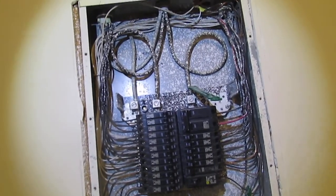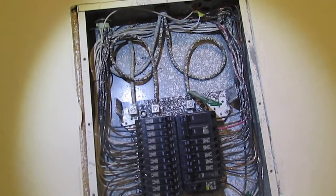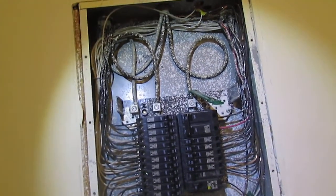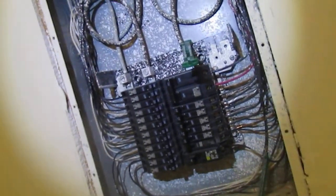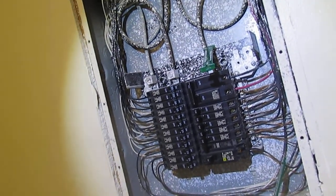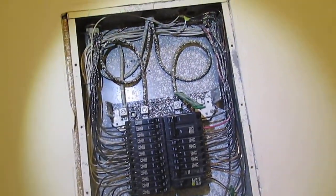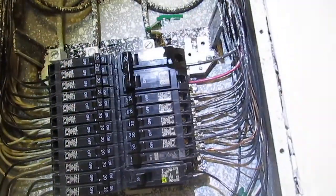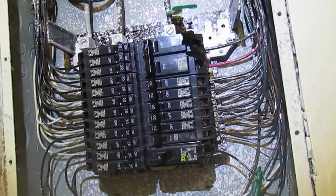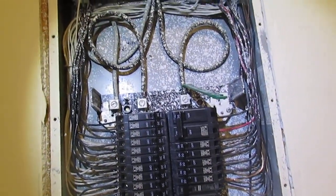That's the reason why you have a home inspection — just for this reason right here, because there are just many things that have to be looked at, and you also have to have the tools to do this. There's probably about twenty thousand dollars in inspection gear and I use most of it. This bar at the bottom is actually the bridging bar that bridges the neutrals and the grounds together, and thankfully that's not in place because they should be separated at a sub panel. Thanks for taking the time to watch this — take care.